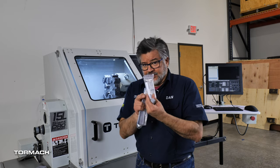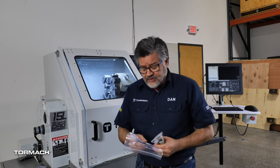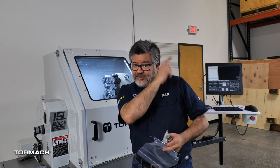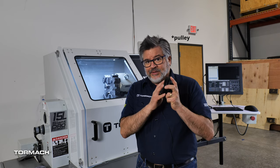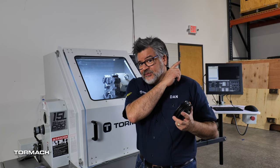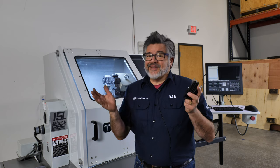Included with the kit are some test pieces to cut and a cutter — instructions are in the manual. Also included are shims for alignment, and a video will be made for that as well. Also included in the lathe kit is an extra pulley belt — this is a high belt which gives you more RPM. The currently installed low belt gives you more torque. Another video showing how to install that belt is also available. We hope you found these instructions easy to follow, and from our Tormach family to yours, be safe and happy lathing.